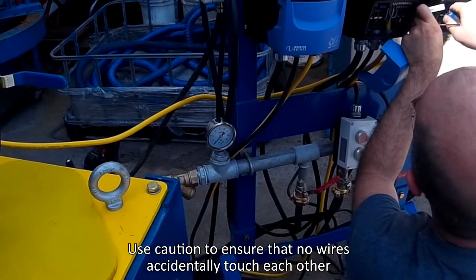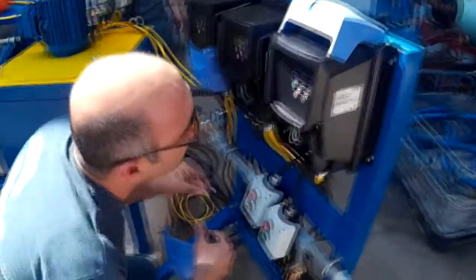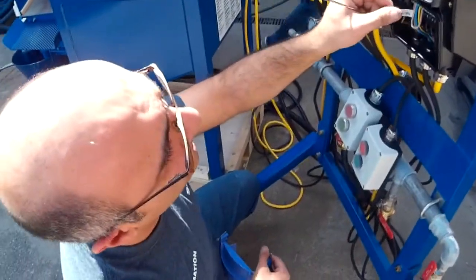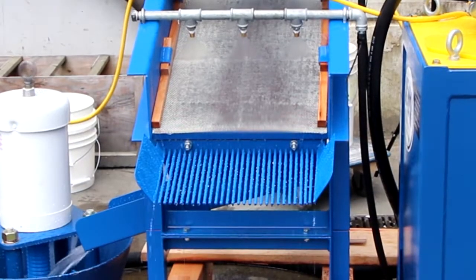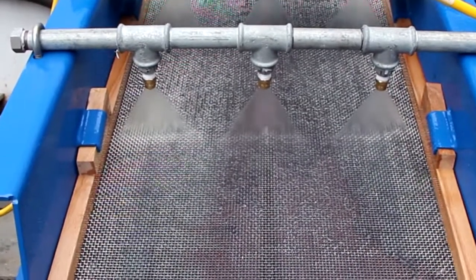Join the three conductor supply wires inside of each VFD. As the electrical plugs add room for error, it is recommended to test each item connected directly to the VFD prior to using the plugs or sockets.